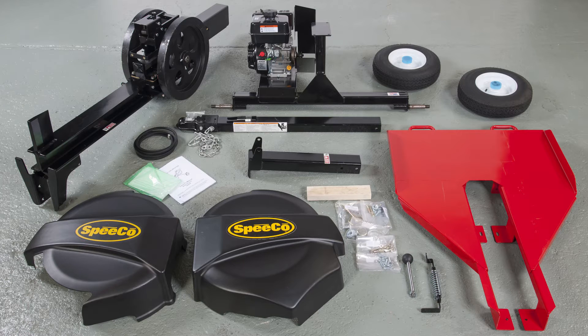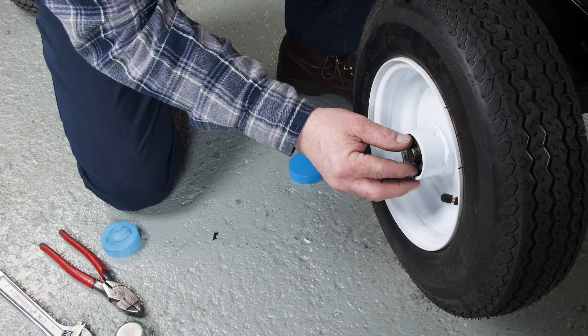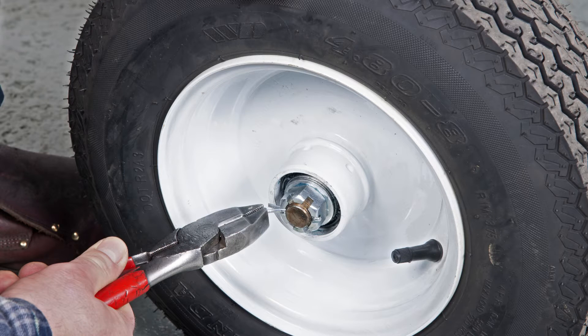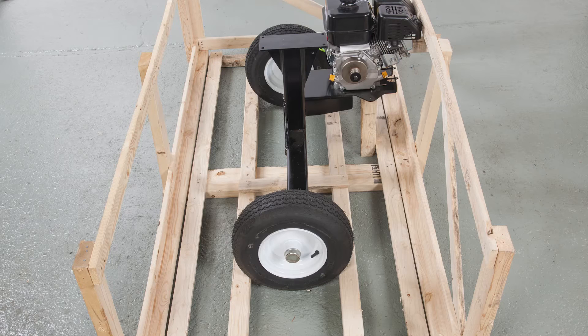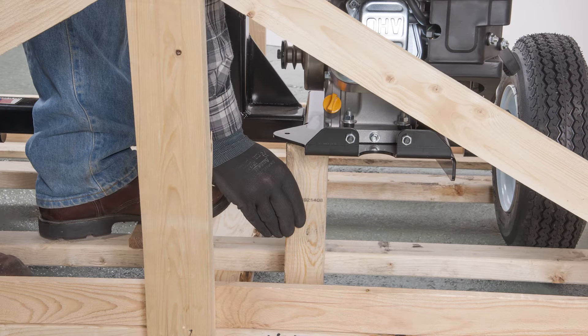Remove all of the contents from the crate. Now mount the wheels on the axles using washers and slotted nuts, with the valve stems on the outside. Tighten the nut until it's firm, then untighten about half a turn and install the cotter pin through the top of the slotted nut and axle. Make sure the wheel spins freely and install the metal dust cap. Next, place the axle and wheel assembly back into the crate with the wheels nested between the two center-most wood slats. Place the block of wood provided under the engine mount to level the axle.